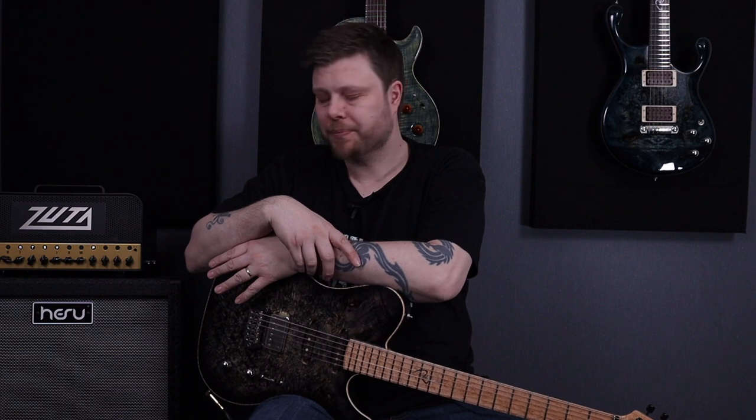What you have there is a bite switch that adds a little more girth and compression and high-end bite to the amp, sort of a power amp voicing switch, you might call it. And then you also have the effect loop. The effect loop has a lot of levels, so you can actually use that as a level boost if you like. What I usually do is I have a delay loop, but also a boost pedal or a level pedal if I want to add some mids, or if not, just raise the level of the loop, so I can use that as a lead level boost regardless of channel if I want. So pretty nifty feature there as well. And of course the cabsim, we'll look into that later, so I'm not gonna mention more about that right now. But with that said, let's listen to some tones, shall we?